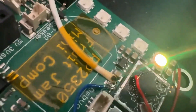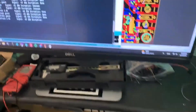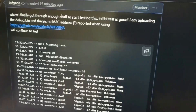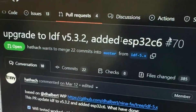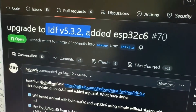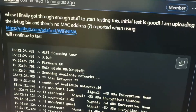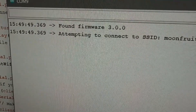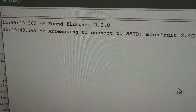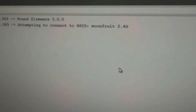The good news is we got a PR merged for the ESP32 NINA firmware and updated to the latest IDF, which adds support for the ESP32-C6 and also fixes a couple other things, including the certificate bundle so it's more modern. I was like okay, I'm finally going to test this. The good news is that it works — I'm running the Wi-Fi web client in Arduino, and of course it'll work the same in CircuitPython.